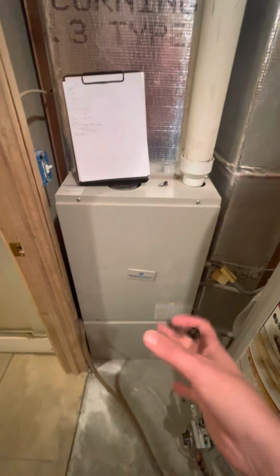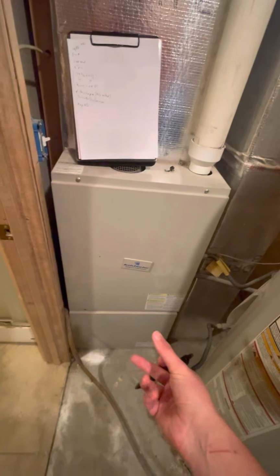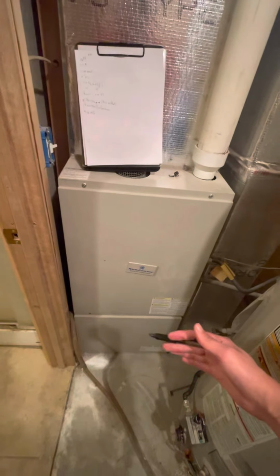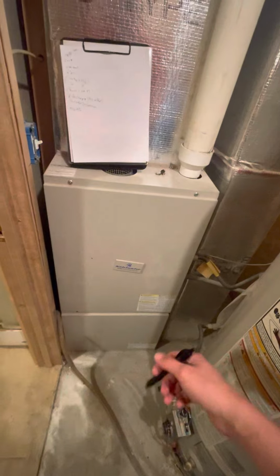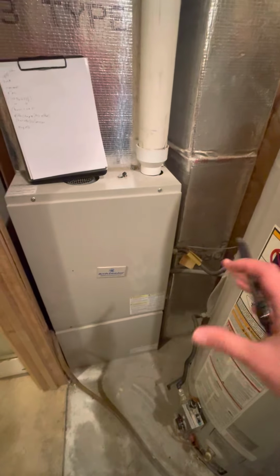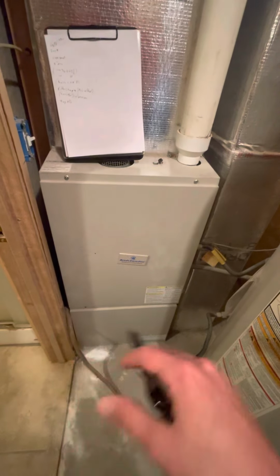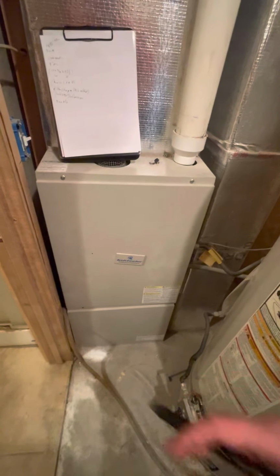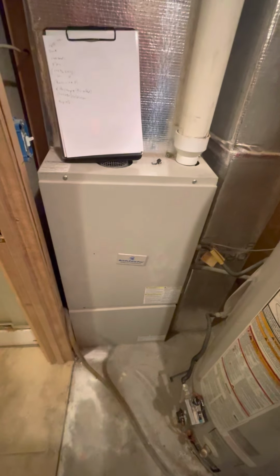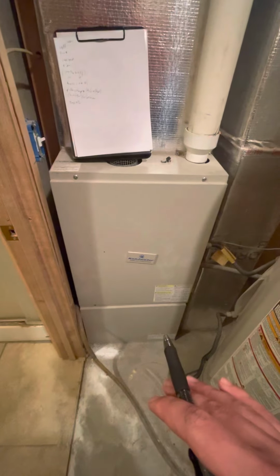For the new setup, this one will need to be on a base anyways, due to the size and tonnage of this fan. Go ahead and just lift it up, and we'll put in one of those easy access panels for her that she can basically just flip up, take the filter out, and put it in. And I also want to implement, because we're having a hard time changing that, and I'm more concerned about the longevity of the system for her, if we can go ahead and focus on showing her how to change that and see if she's capable and able to with her hip, or if it's not feasible, it's okay. I would offer our services to see if we can come out and do that for them, or if she can have her daughter Cheryl or someone else tend to that for her.